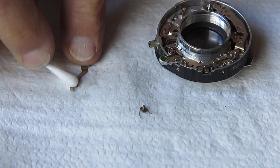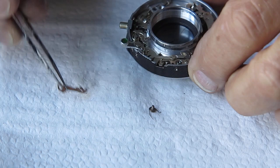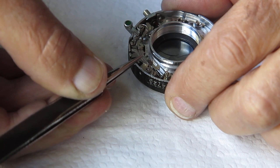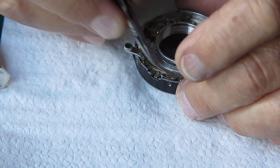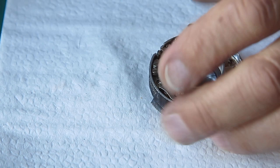I've got the B lever here. The B lever's job is to hold the shutter blades open when you hold your finger on the shutter release. It pivots on a post on that plate and is held in position with a screw, with its return spring around a groove on the screw. It's important that this spring stays seated around the groove of the screw — it doesn't get trapped underneath it.